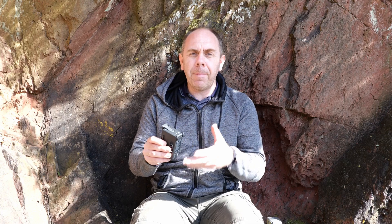For long-term storage, DJI batteries store ideally at about 50% charge — roughly two lights and one starting to flash — which is somewhere between 50 and 65% or about 3.85 volts per cell. If storing long term for winter, charge them to about 70% and check them every few weeks to make sure they haven't dropped too much. Many newer DJI batteries will enter a hibernation mode if unused for some time. I personally check my batteries every couple of weeks and run them through a cycle every month or so to keep cells exercised, the fuel gauge up to date, and the cells balanced.